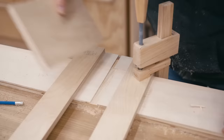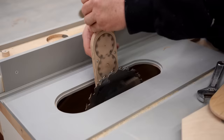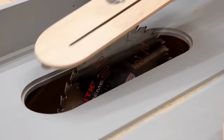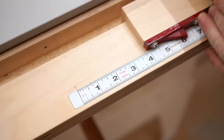I'm making this project from scrap plywood and I really can't overstate how much of a difference a good quality sharp saw blade makes to the performance of your table saw, especially when you're cutting plywood and you don't want to mess around cleaning up the saw cuts. So I'm taking the time to change the old dull one for a new one from CMT that's very sharp.